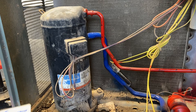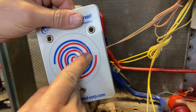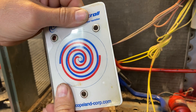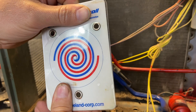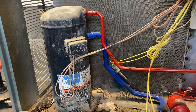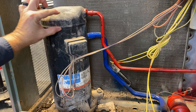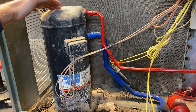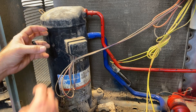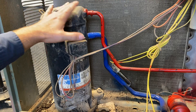I have this other little demonstrator. We can see the open position where the refrigerant will start to come in. As this scroll moves around, it works kind of like a hula hoop — one stays stationary and the other one just squeezes it in more and more and more until we finally get to high pressure. At the very top, we dump it into this chamber. The very top section here is just an open chamber, and this works as a muffler. This is going to be very hot at the top, but it also allows the gas pulsation to smooth out.